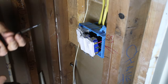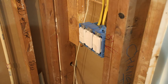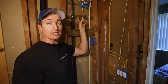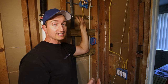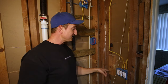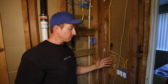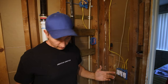Now we push everything back in — I hope it fits. We put a test light up there and it's working. Now we have the electrical roughed in: we've got the outlet box for the lighted mirror, and the electric box for the traditional vanity light. Everything runs back down to the switch arrangement here. The power coming in goes through a GFCI that feeds all the switch circuits and the continuation circuit leaving this bathroom, so everything will be GFCI protected. This wall is now pretty much ready for drywall.